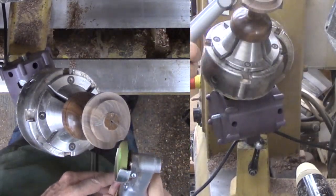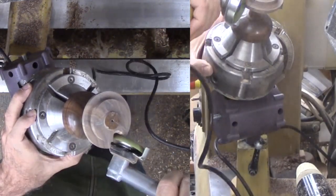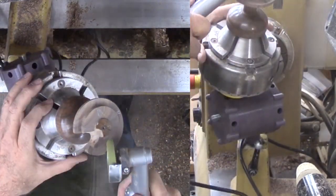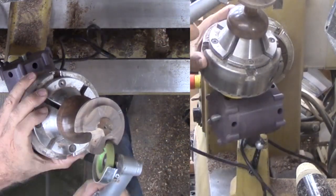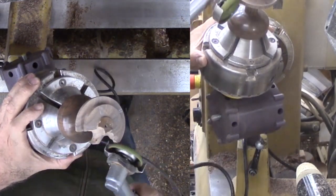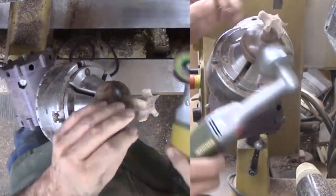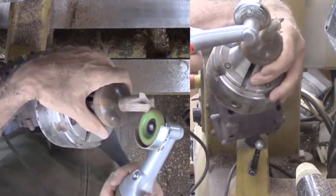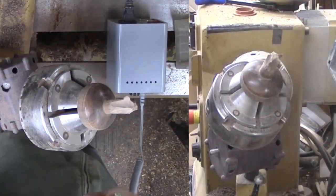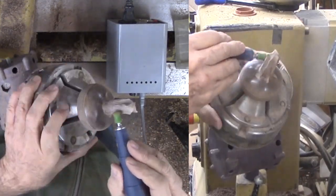I am experimenting with a DIY carving stand. It is made of a 3D printed threaded hub for the chuck, some nuts and bolts, and a steel shank for the chuck hub. With it mounted in place of the tool rest, I can position the wood in almost any orientation for access while carving. With my right angle carving tool, I rough cut away the old tenon. Then I switch over to a rotary carving tool with a different shaped bit. This will not remove as much wood but is more controllable for shaping.